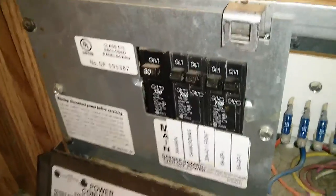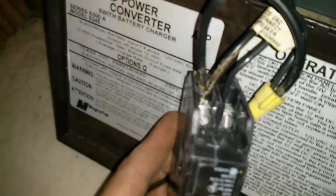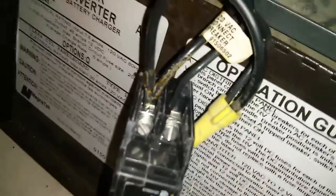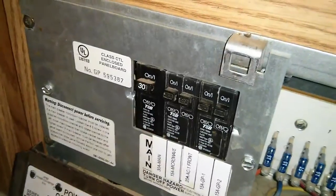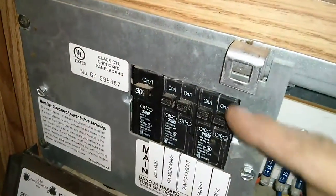Now that I've got everything disconnected, I'm going to pull this panel off and switch things out. I've got the panel off and I pop this breaker out — you just pull it out. You'll see one of these wires is conveniently labeled 'converter hot input,' so I'm moving this cable over to have just the battery charger coming off this switch so I can manually enable and disable it. Everything's all wired now so the battery charger can be turned on and off with this switch.